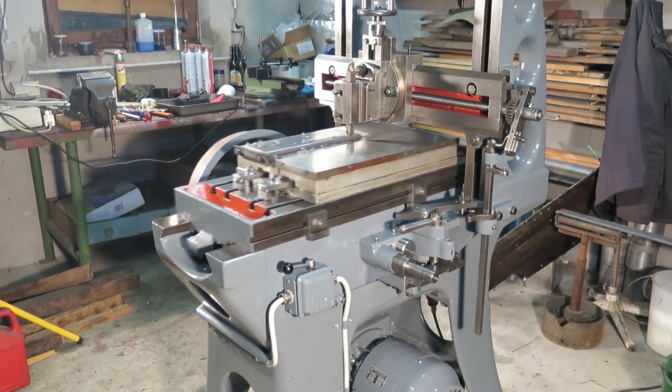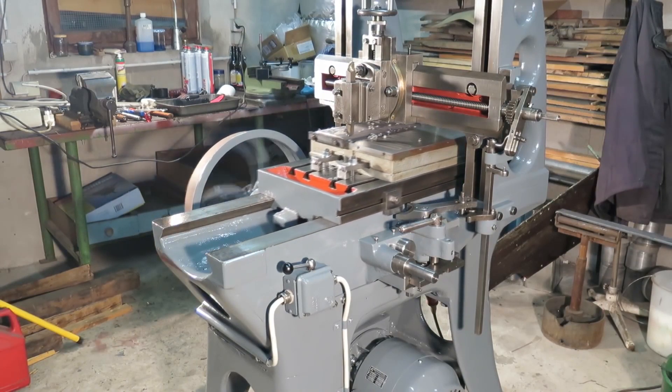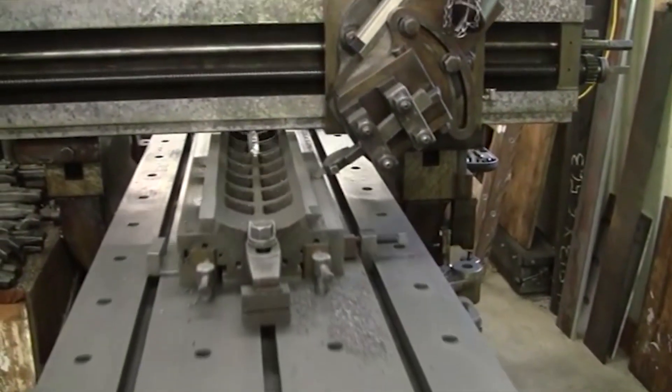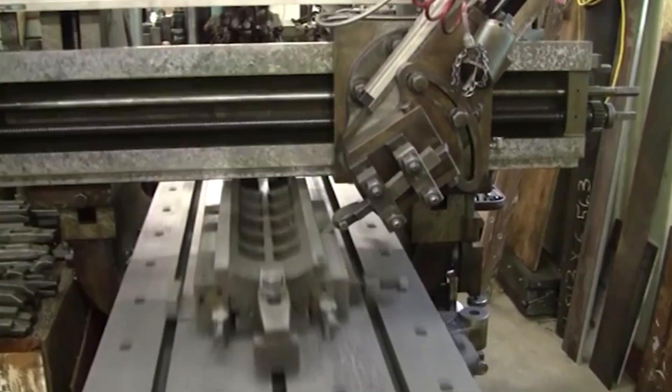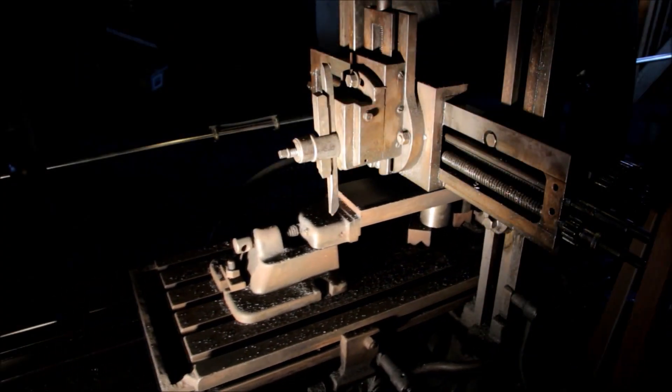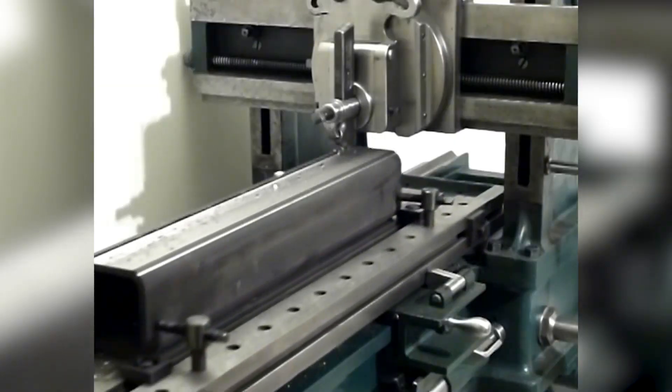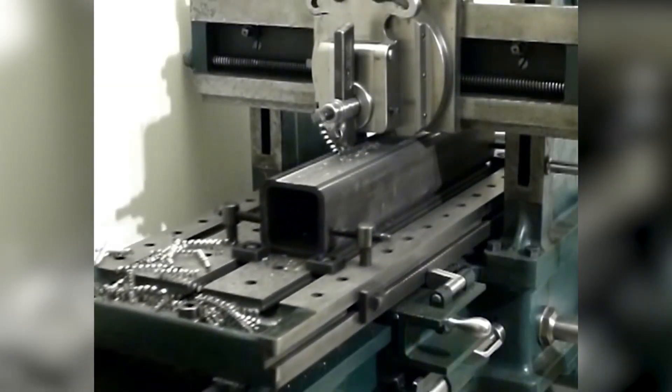The machine is made up of a thick single-point cutting tool and a platform that holds the sheet of metal and moves it against the cutter. They are great for creating flat surfaces on metal, and can also be used to cut slots like keyways, and even the creation of internal features like irregular holes, as the cutter can be lowered into a pre-drilled hole as a starting point for the work.